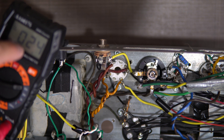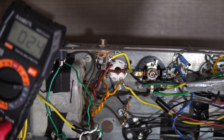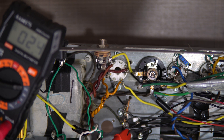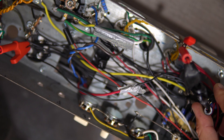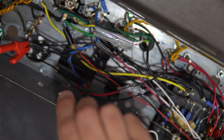Now just to test it again — I currently have 24 volts DC on this node here, so I'm going to take my filter cap draining tool again and give it another drain. You can see it is draining the voltage down. The tool has one part clipped onto my chassis and the other part is touching that resistor on the voltage supply, with a resistor in between to slow the flow of current as the remaining voltage seeps to ground. Now that I know this amplifier is completely safe to work on, let's dive in.